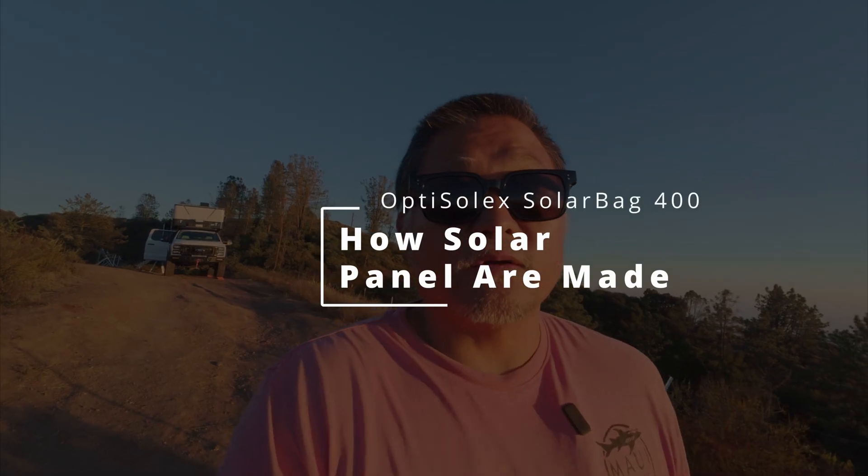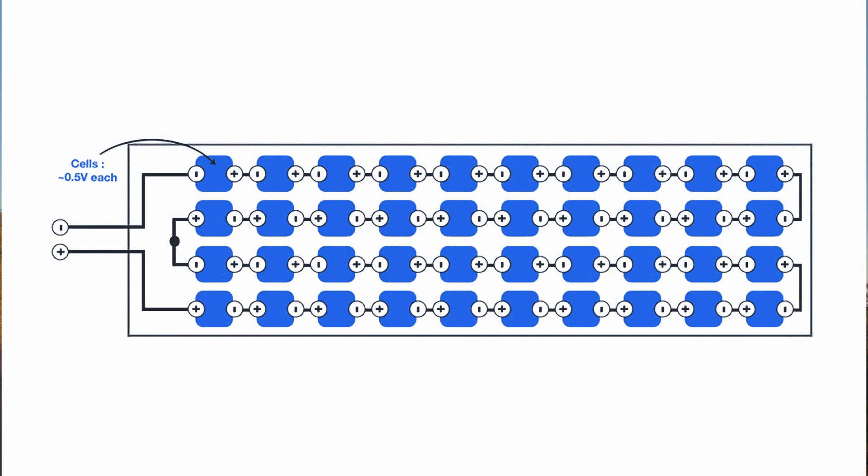The first thing we'll talk about is how solar panels are built. At the heart of every solar panel are solar cells, typically made from silicon. These cells are the building blocks of a panel and they're small but powerful — each solar cell produces about half a volt of electricity. To reach usable voltage levels, cells are wired together in series within the panel. A panel of 40 individual silicon cells wired in series will have an open circuit voltage of about 20 volts. Most common commercial solar panels output about 20 volts, and a typical 100-watt panel can deliver about 5 amps under optimal conditions.